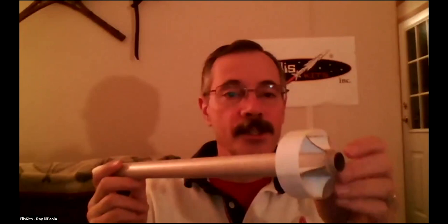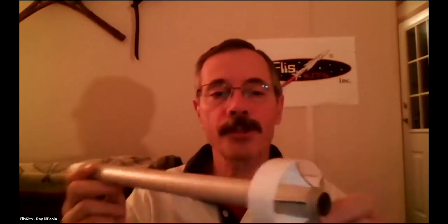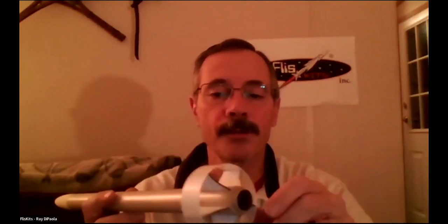Now, a couple other things in the past year. Shifting back to low power, we did introduce another educational kit, and we sold this to a number of groups here in the Northeast. It's designed to be a very inexpensive kit. The fins are laser cut from cardboard, and to make the whole thing strong, we've got a ring that ties them together. It comes with a jig. You get one fin on there, sort of straight, slide the jig on, and then let everything cure. After that, it's just slotting the other fins in one after the other until they're all done. And then when that's dry, take the jig off and pop the ring on with some glue fillets.